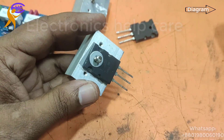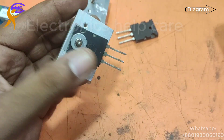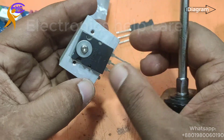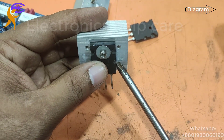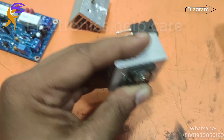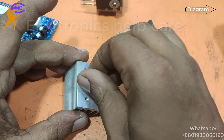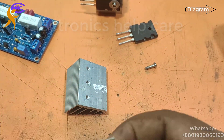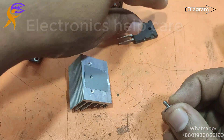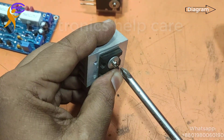The paste and the separator help with cooling the transistor. The separator's main job is to separate the voltage. Make sure the transistor is tightly fixed to the heat sink. I am using separate heat sinks because I don't have one large enough. The separator is required to maintain electrical isolation.